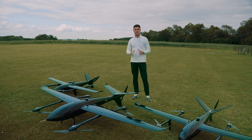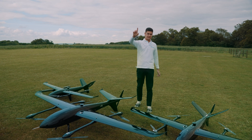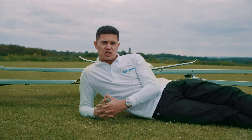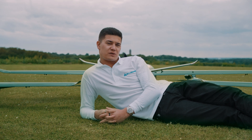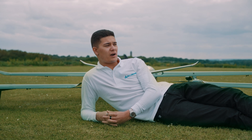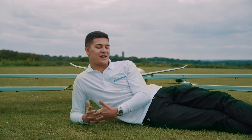After checking connectors, we replace the batteries with a previously flown set and go in for a fixed-wing flight. Once in fixed-wing mode, the aircraft does a loop around the testing facility where we test speed performance, handling, and whether all the control surfaces are set correctly to the client's reference. Some clients need very stable and smooth flight because they carry expensive sensors — from NextVision Raptor cameras to five-band cameras or LiDAR sensors with gimbals. Some do wildlife tracking, some help keep the country secured, so we test stability and smoothness to ensure a very comfortable flight.